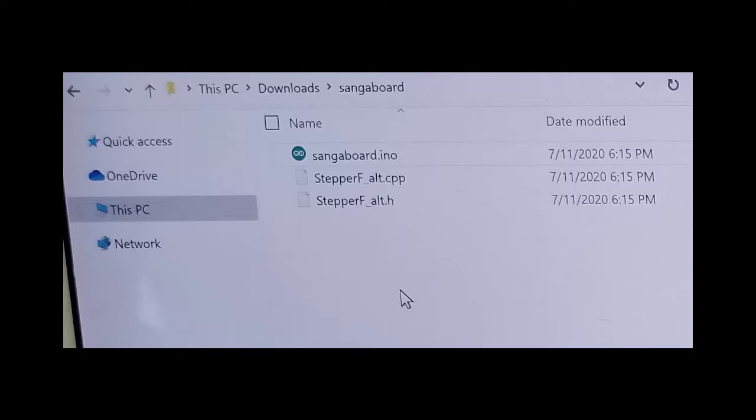Okay, really quickly for the Arduino code loading to the Nano. When you download the files, make sure that you have them renamed. When I downloaded them from online, they had longer names, and you can get errors when you try to load them. So see what I have here, make sure your files look like that.